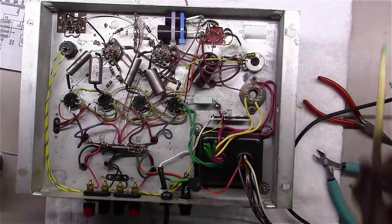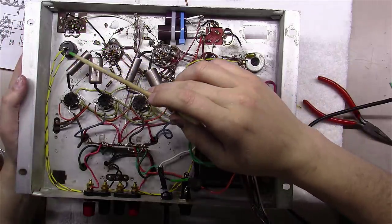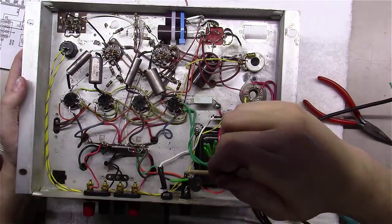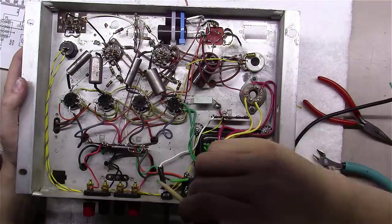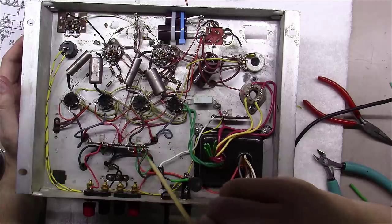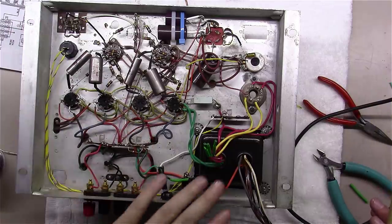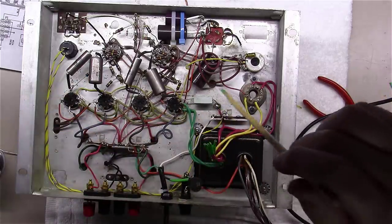Okay, we had a few things to do here. One, I installed a power switch over here, so from the top, I can just turn it on and off. Ran two wires around, tagged one over here, so this is where the transformer is going to tie. The other one went to the other side of the fuse here. Came off the other side of the fuse with a thermistor that I took to the hot wire here on the power cord. Took the green cord over here over to ground. Took the orange shield wire over here to a ground lug that's connected to the chassis. So all that should be good to go. That was not a part of what you would have to do to replace this transformer. It was a part of what I was wanting to do to this Maggie to get it up and running again properly.